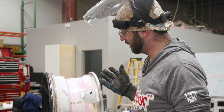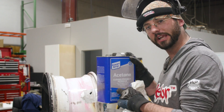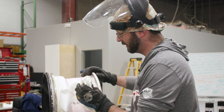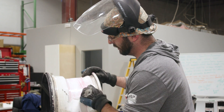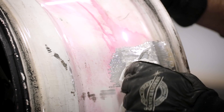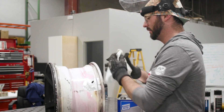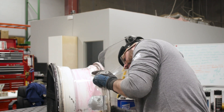The die pen process is all done and cleaned off. I'm going to go over it with trusty acetone — I've got my gloves on. Get that on a clean rag and get in there, making sure the material is nice and clean. Get in that hole and make sure you don't see any type of indications or contamination. Get all that schmutz off the wheel.